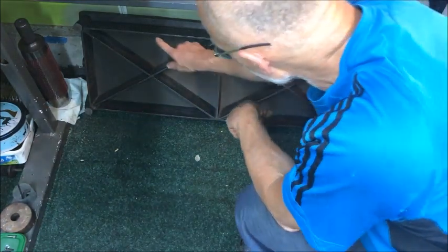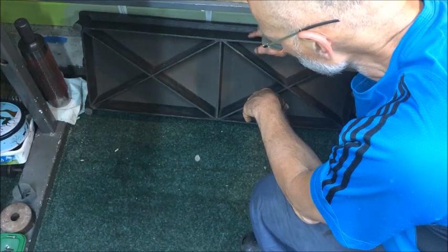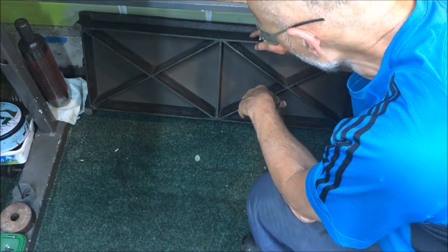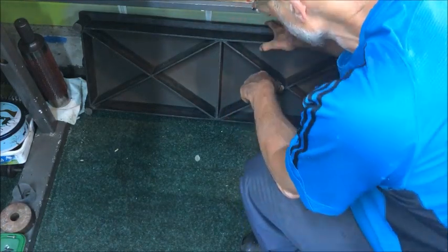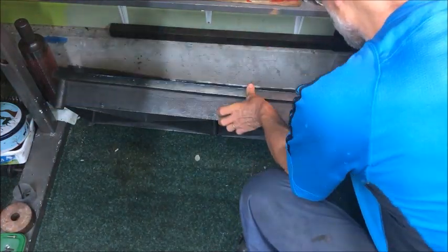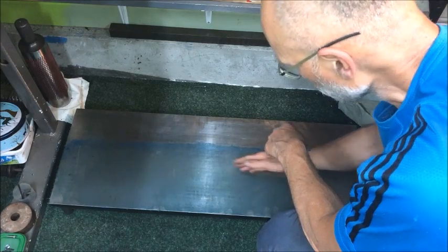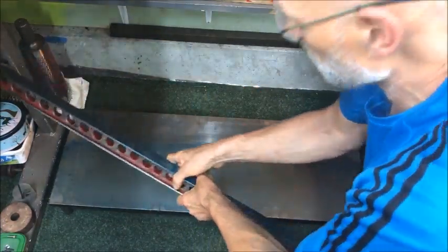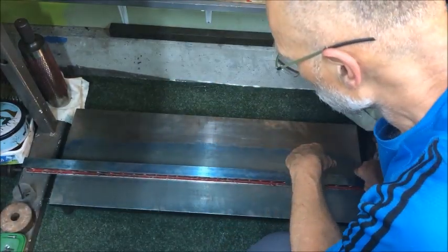It should be here, here, and here to even out the weight of the casting itself. I guess it was planed and ground in some way so they proved it flat, but I'm pretty certain that the way this is now sitting, it's going to sag in the middle. Thereby, when you measure across, it will measure as hollow in the middle, hitting only on the ends.